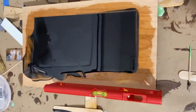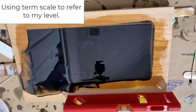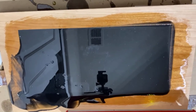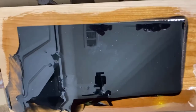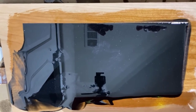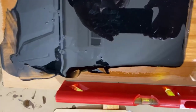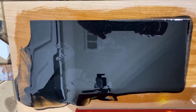Let me show you what happens if you get distracted. I got distracted, and I didn't really believe my scale because I saw the epoxy leveling out to one side — so I actually raised it up even though my scale said it was level — to make sure the pour would stay inside the pocket and not go all over the place. I made a mistake, because while I wasn't paying attention doing some computer work, I came back to heat it for bubbles and my epoxy had run out. I'd made it too high on one side and the epoxy had all run out to the right. So now I've done another adjustment, using the level again, trying to believe it.